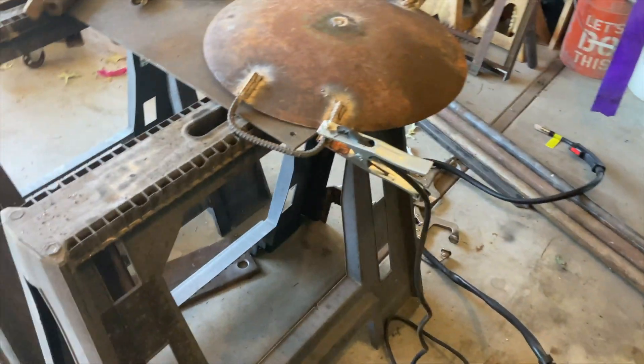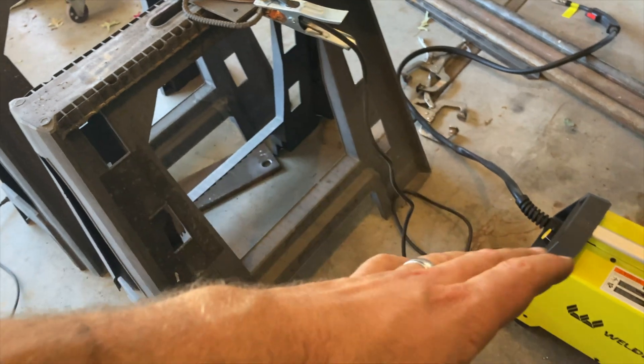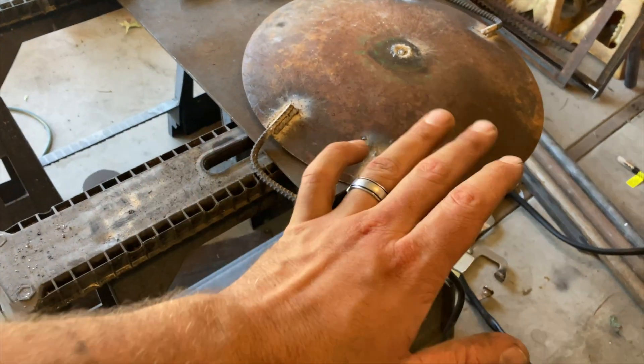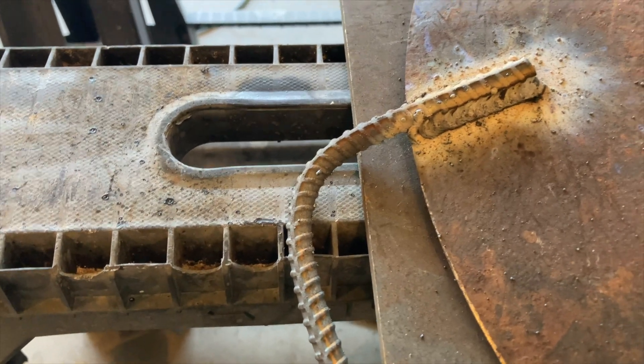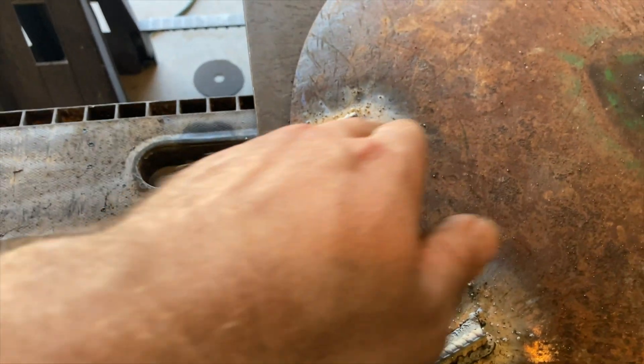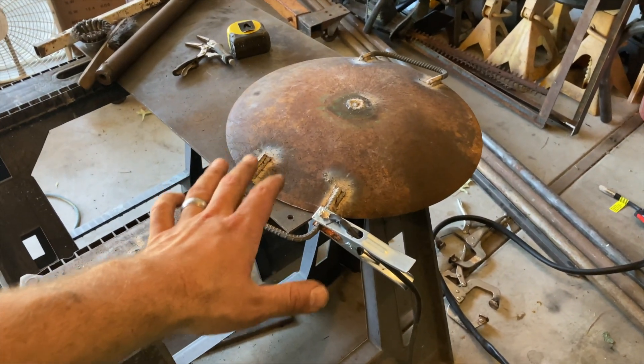Man, I am really impressed with this little welder — 300 bucks. It is way smoother operating than the Harbor Freight, at least the Chicago Electric one. I can't speak for the Titanium series; I haven't used any of them. I have used the Chicago Electric variety, the one that's the same amperage as this, and it is not near as good. This thing is pretty rad for 300 bucks. That rebar was glowing red when I finished the welds, and the plow disc was red too — that's about 3/16 steel and the rebar is 3/8. So I feel like it's getting pretty good penetration. I'm excited for what we're gonna be able to build with this thing.